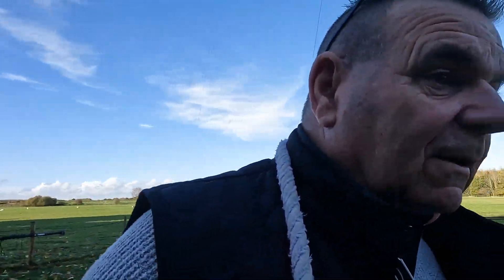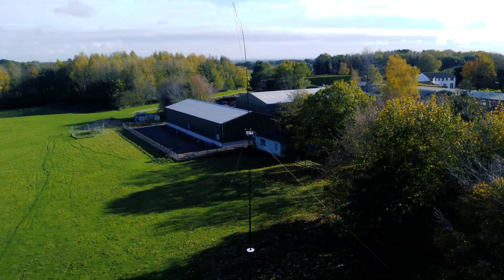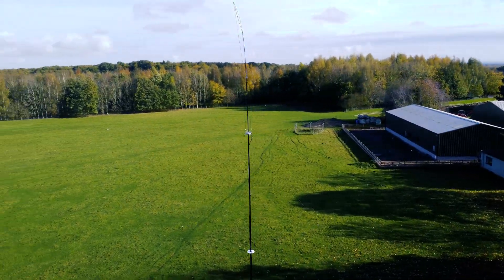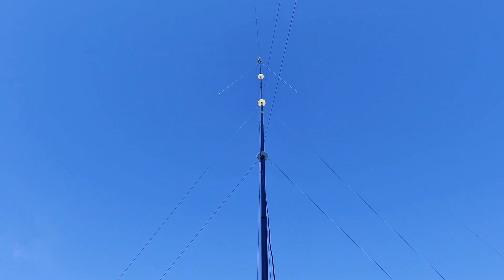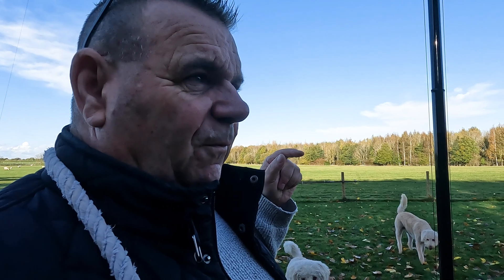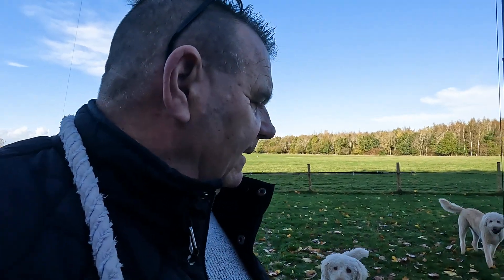What have we learned? We've learned that a capacity top hat doesn't have to be physically connected, and that a harmonic on a capacitively loaded element gets screwed around with — it went way up to 26 MHz. All in all good fun. Not the sort of thing I can sell, but the sort of thing I might be able to inspire you with. Watch the next videos coming up and I'll see you soon.